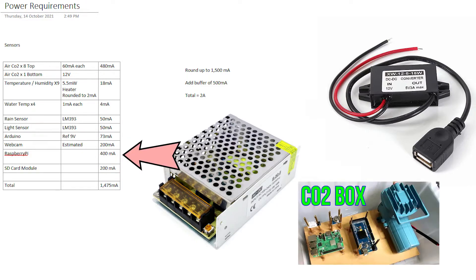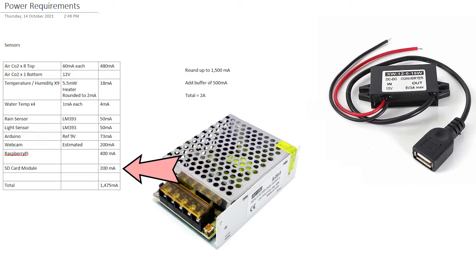A Raspberry Pi 3B+, which I've taken into account being a bit loaded, but I don't think it would be at that full amount for the majority of the time it's running. We've got an SD card module. I kind of forgot a couple of little things which I noticed while filming, but on top of that we're also going to add some extra things down the track. So what I've got is 1.5 amps, which I've rounded up, and I added a buffer of about 500 milliamps, which got it to around the 2 amp total.